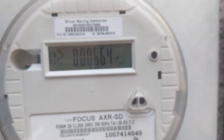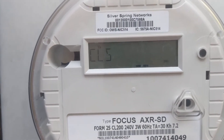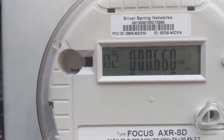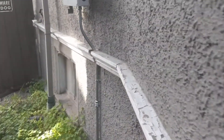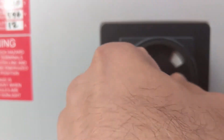We're about to turn the solar on for the first time. Here is the smart meter — 240 volts. Total kilowatt hours going at a 0.659 kilowatt hour spot rate. So let's turn on the solar, turn on the power wall. Now let's walk over to the actual battery and turn that on. This green light is good, I hope. We'll go to the inverter, which is off, and then turn it on.